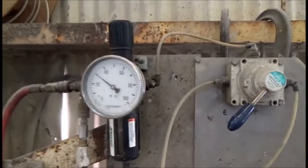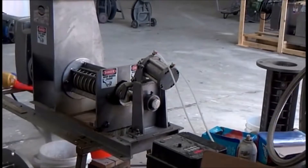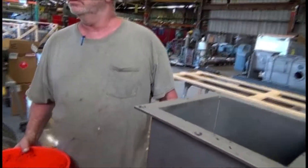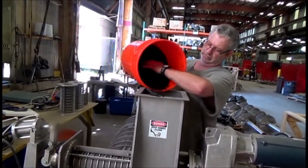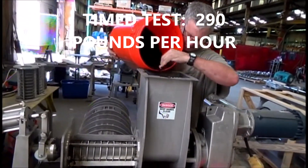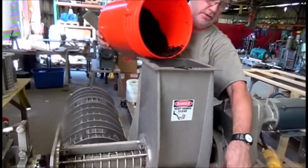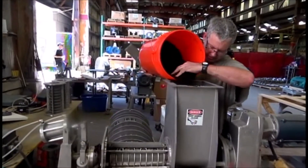I'm going to stop it and set it at 2 bar — 30 psi. We're going to run a timed test. I'll start the machine — CP4 lab press — and Bill will feed stuff into it. Just enough to cover the screw so it doesn't bridge. I've got 30 psi on there and that cone's open pretty far, doesn't look right to me. We're going to start the test now.